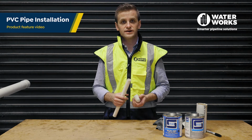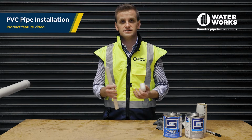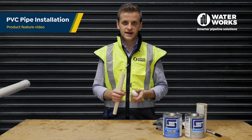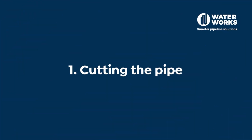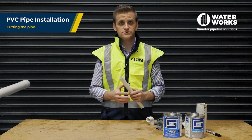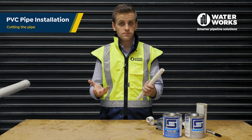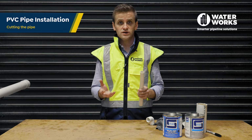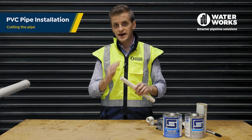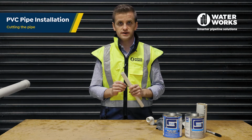In this video we're going to run over some of the basic installation procedures commonly used in PVC piping applications. Step 1. Cutting the pipe. PVC pipe can be cut using a ratchet cutter, wheel cutter for plastic pipe, a power saw or other fine tooth saw. It's important that the pipe is cut square to give you the maximum bonding surface area.